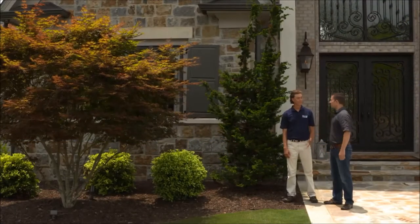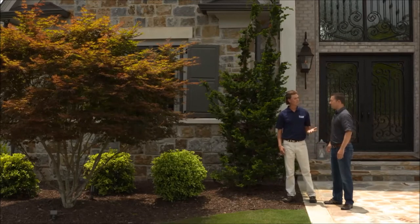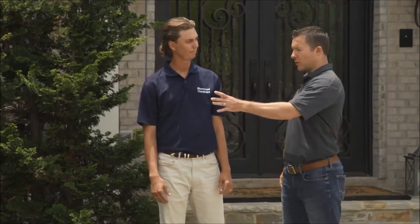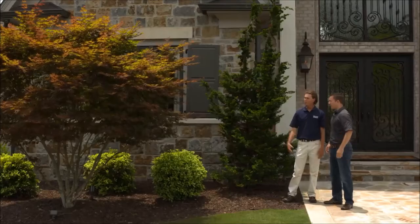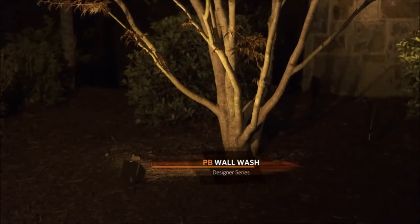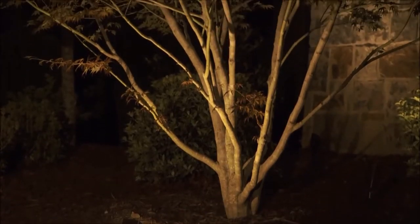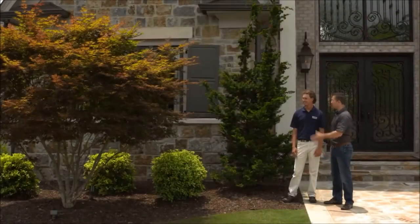On the front of the house we have two separate lighting needs: the landscape and the architecture of the home. For this maple, we chose the PB wall wash. It's a smaller maple but very wide, so instead of using two up lights we use one wall wash. That helps with the width of the canopy, looks great, and saves the homeowner money since you need one fixture rather than two.